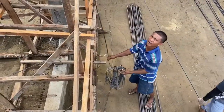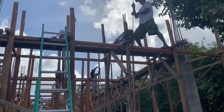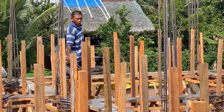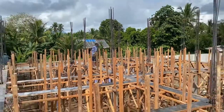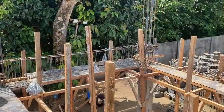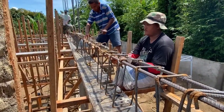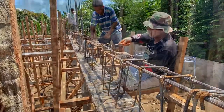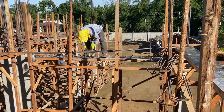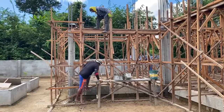The bottom of the tie beam is right in line. Making a start with the first tie beam. For the garage we use an extra beam to lower the entrance — we don't want a 3-meter entrance, we lower it to 2.20 meters. The boxing in is complete, now we go for the pouring.